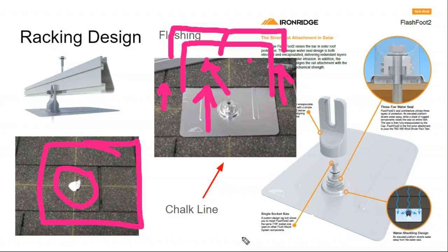Usually the leaks will occur due to pre-existing rooftop obstacles, where the installer is tromping around on the rooftop and maybe stepping on some flashing between a chimney and the roof. That empty space on the roof becomes a walkway. And so it's usually those pre-existing flashings that are already 10 years into their life cycle that need special attention when it comes to waterproofing.